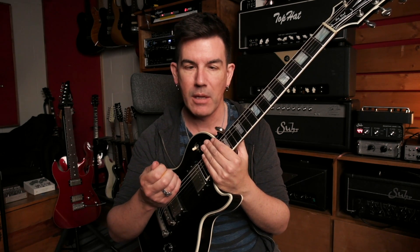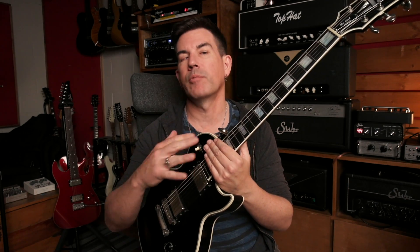There are different values of cap that you can use, and this is going to shift the frequency where the cap sort of becomes active. Early Marshall amplifiers used a 100 picofarad cap — that was like JTM 45 amps, the real early ones. Then the value of the cap gradually increased all the way up to like 4,700, getting into the 70s. You can mess around and try different values from 100 all the way to 4,700 or 5,000 and it's going to affect the response of the amp. As you get up closer to 4,700 or 5,000, that really big bright cap is letting through more of the upper frequencies and it's kind of shifting down into the mid-range, almost becoming like a high-pass filter that's shelving off low mids and low end.